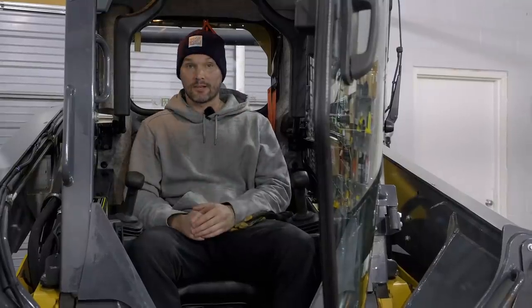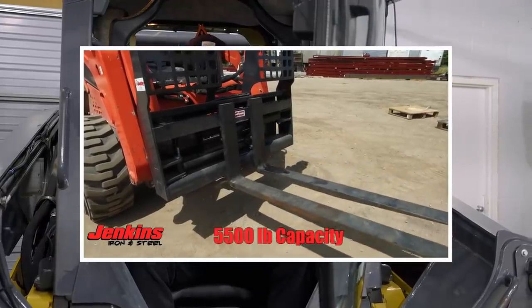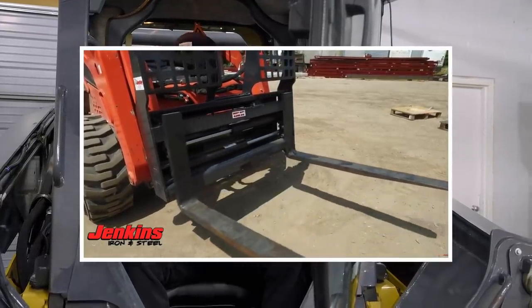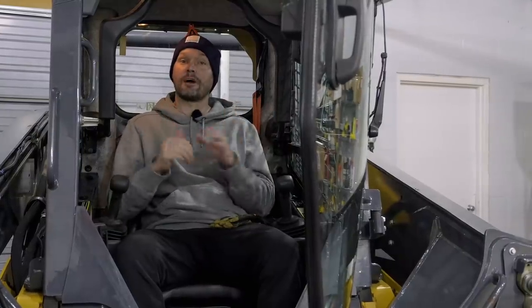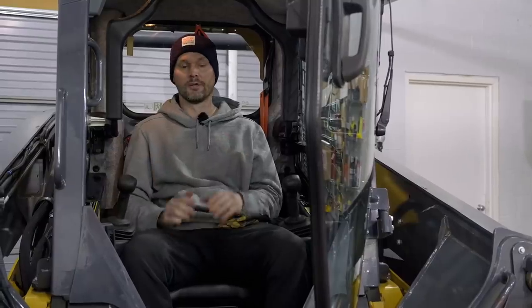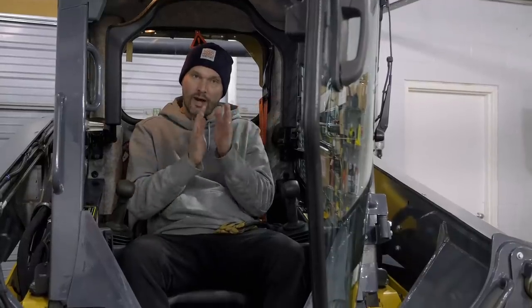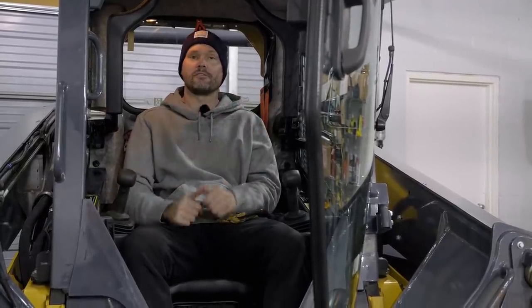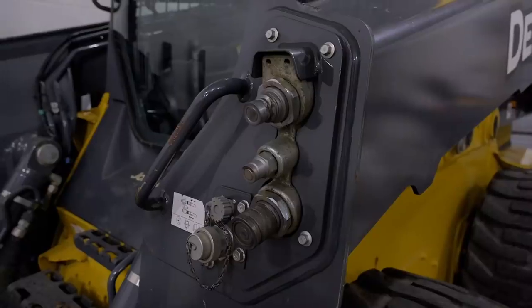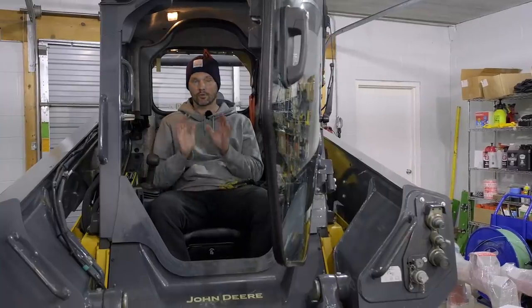One thing I'm really excited about getting for myself is a set of hydraulic forks. Most forks have to manually slide along the rail, but for my shop we're moving pallets and equipment all the time. Having the ability to not leave the operator station — just hit a button and have the forks widen or narrow — is going to save a lot of time and make us more efficient. But as the theme of this video goes, you need the additional hydraulic function to do that.